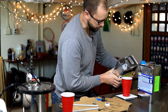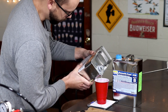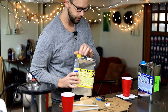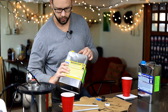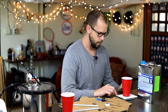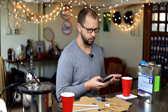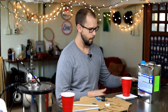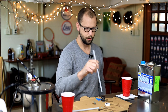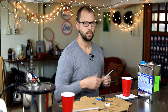Make sure to put paper down when you're doing this because anything that spills is really hard to clean up, especially if it cures. If you're not exactly spot on with the measurement, don't get too worried — this stuff is pretty reliable. Now I'll zero the scale, and this is when I'm going to start my stopwatch because as soon as you mix Part A and Part B together things get time sensitive. Once I mix this I'll just dip my mixer into the black dye — you could use a syringe for drops, but a little dip will be plenty to make these handles nice and black.